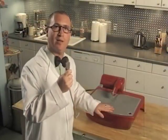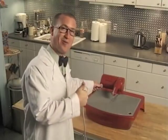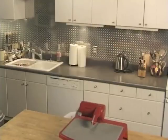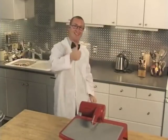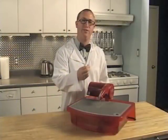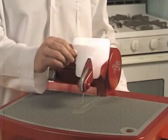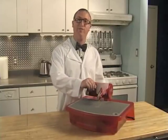Now we're ready to plug it in. Before we do so, let's make sure the switch is down and in the off position. In order to supply power to your saw, simply plug it into a grounded outlet, or use a grounded extension cord. Let's not forget to install the face shield. Simply slide the face shield over the nose until the pegs slide into the indentions. Once in place, you can flip it up or down as needed. It's always a good idea to wear eye protection.